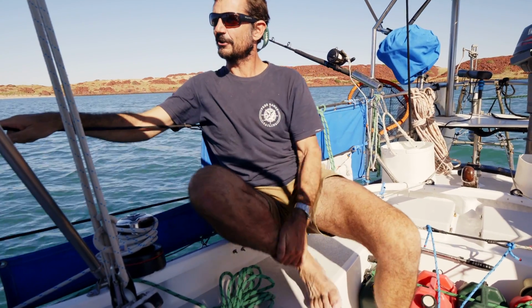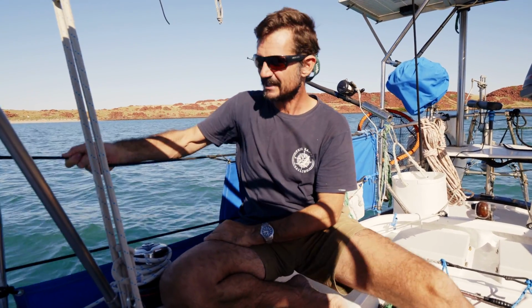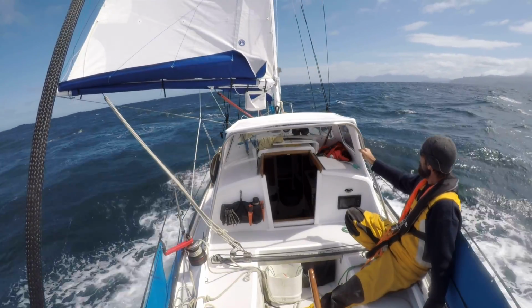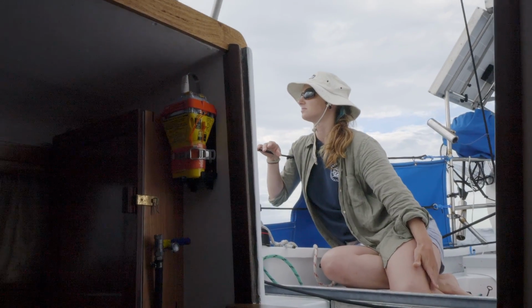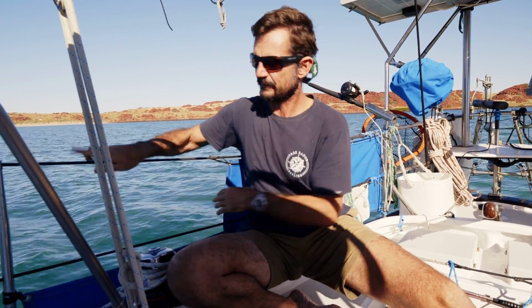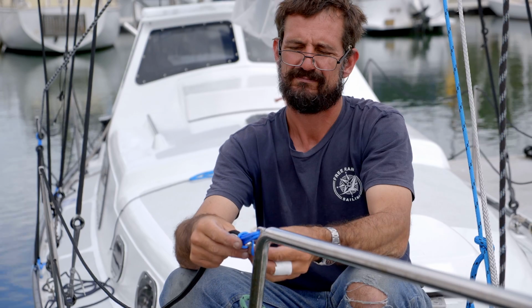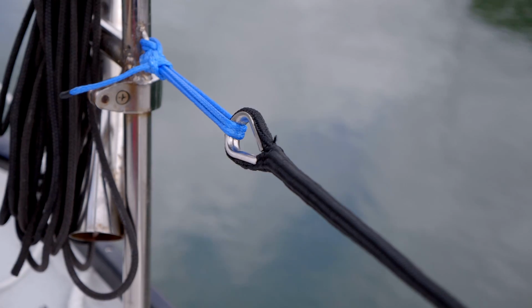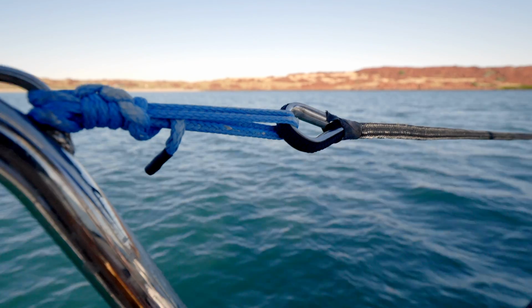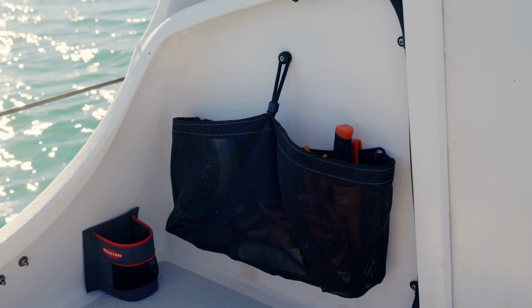Oftentimes, if you look at some of our videos, we might be jammed in place when we're really having a good look. These are so much nicer to hang on to. You get a thicker grip, so it's easy to actually get a grip on these, which in an emergency might be important. They're really comfortable to lean against, and I've left them so there's just a little bit of give. I haven't left them slack at all, but there's just a little bit of give to them. The way that we secured them, I used these thimbles because it was a cheaper option than using low friction rings, but we've whipped it at both ends, and that means if I ever do see any little bit of chafe, I can adjust it at either end to freshen the nip a little bit.